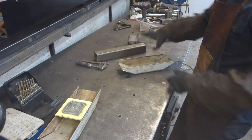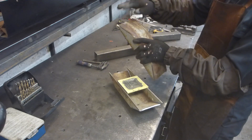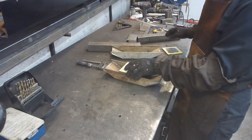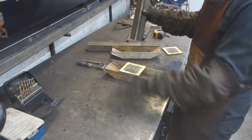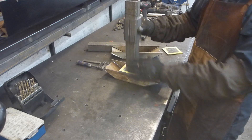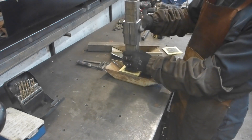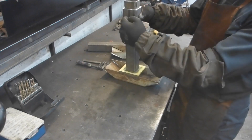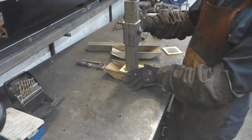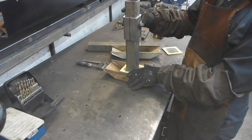For the skid shoe, we use that piece that we cut and bent. We are going to weld a quarter-inch plate to a two-by-two tube. For the adjustment sliding, we will use a mechanical tube — so inside there is no weld and it slides pretty much as a fit over a two-by-two. We will be able to make the height adjustment, with no pinch point whatsoever. It will keep track of the direction of the plow.